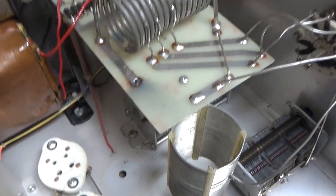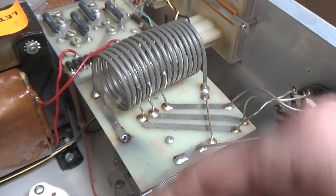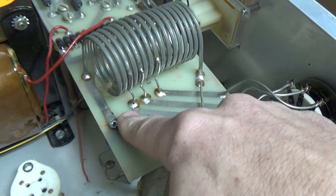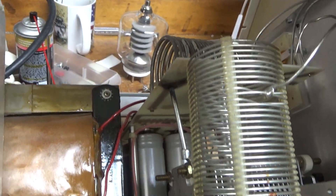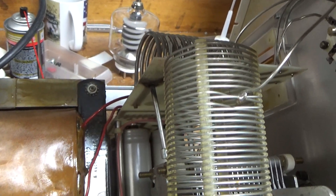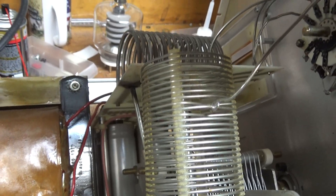When I removed the plate choke and the plate blocking ceramic disc cap, I noticed the solid conductor was not protruding through the board and the solder trace. Look at that — got all hot and burnt up under there. I can fix it: scrape the carbon off, and I'm going to lengthen that conductor so it goes up through the board, not just touching the bottom of the board.